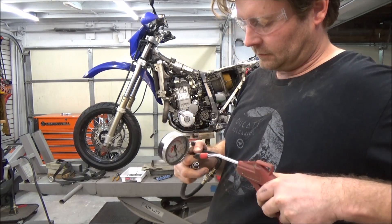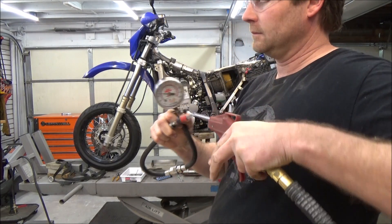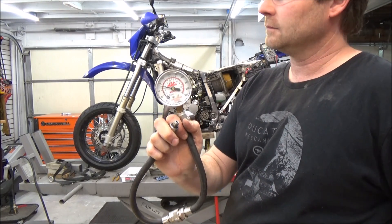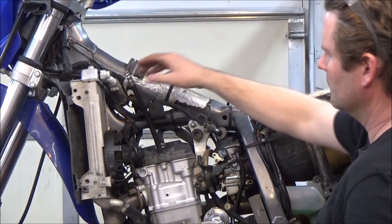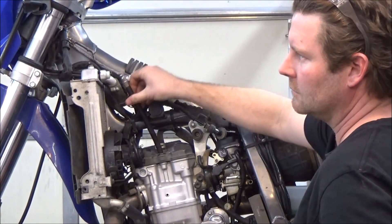I'm going to do something here that most people never do — test their tool — and go ahead and push up the gauge with my air compressor, matching the gauge to my compressor. I'm verifying I have two gauges that read the same PSI.